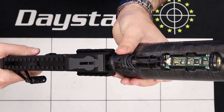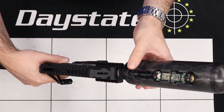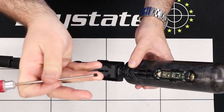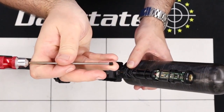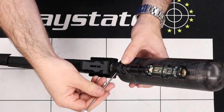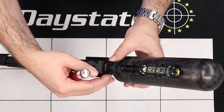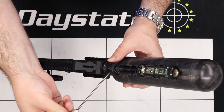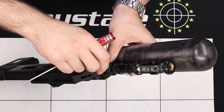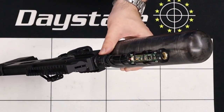Looking at the front of the rifle, you can see the connection — gently slide the connection on the back of the shroud into it. Next, use the securing grub screws to secure the back boss of the shroud onto the rifle. If you removed both sets of grub screws, the shorter ones go in the top and the longer ones go in the bottom. Before tightening, make sure the back boss isn't hard against the front of the rifle — there wants to be just a tiny gap so the shroud itself isn't hard up against the rifle. Once happy with the position, tighten up the grub screws with a two and a half millimeter allen key.